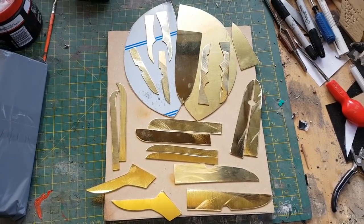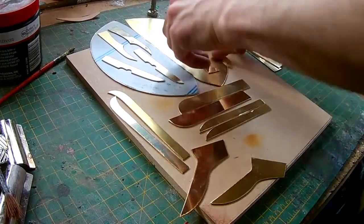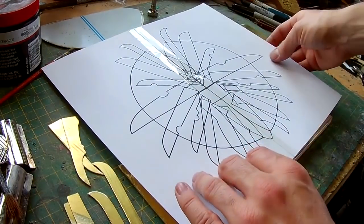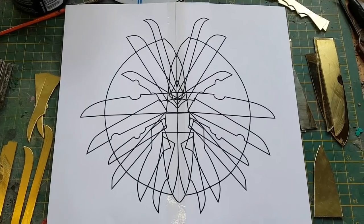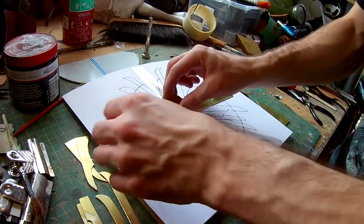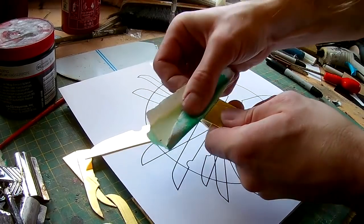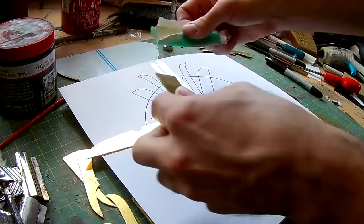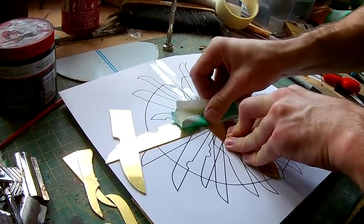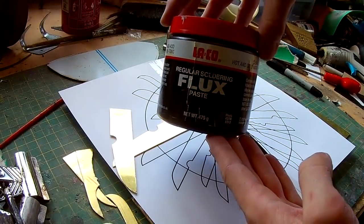So that's all the constituent parts and what I now need to do is to join these all together. Because they're all made of brass I'm going to solder them together using a blowtorch. The first thing to do when you're soldering is to sand the pieces to get rid of any oxidation on the surface and any other contaminants that might get in the way of the solder. Then you put some flux down on the pieces of metal — where you put the flux is where the solder is going to go when you heat the pieces up.